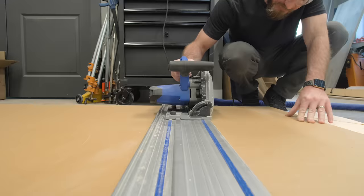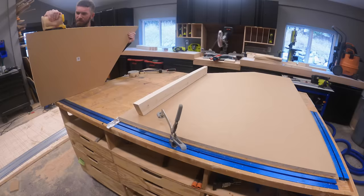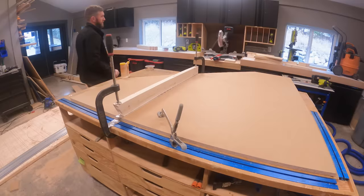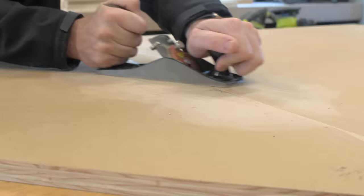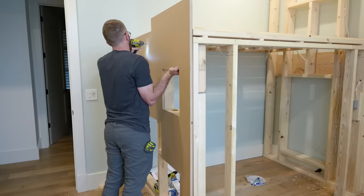For the exterior surface on the wall, I could have simply gone with some half or quarter inch material. However, I needed some rigidity to not only support the stairs on the end, but also support the railing above it. And since I was limited on space, we decided to go with 3/4 inch MDO. MDO is essentially plywood with an exterior surface of MDF.